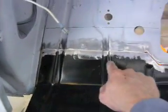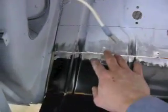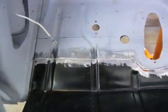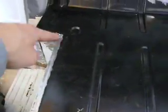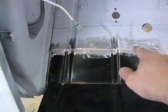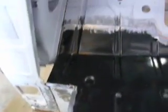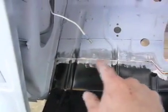My thought process behind this was, let me get this on here real quick. My thought process was all these cuts, flanges, edges, and my plan of attack revolves around this. The reason why it revolves around this is because this is the open butt weld, this is the most important part, and these lines have to line up. So say I scribe and cut everything all out, say I got open butt welds like this here, and here, and here. That means when I line this up, due to human error, I might take this out of alignment. I might take this out of alignment. I might take that out of alignment. So, my whole thought process revolves around this.